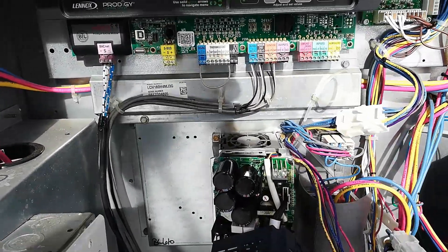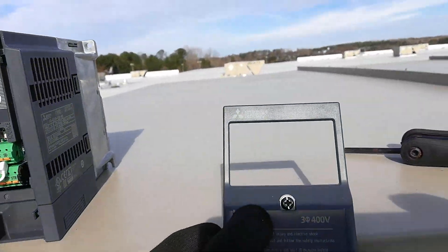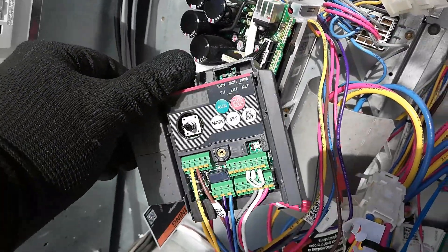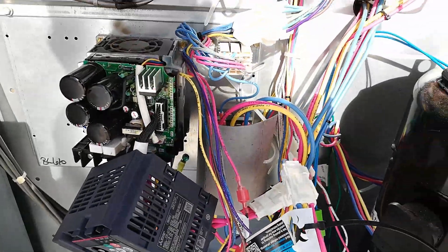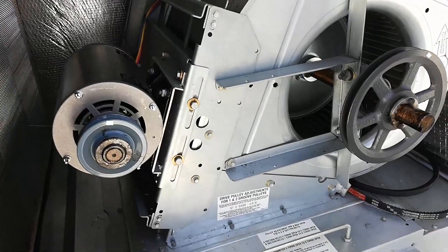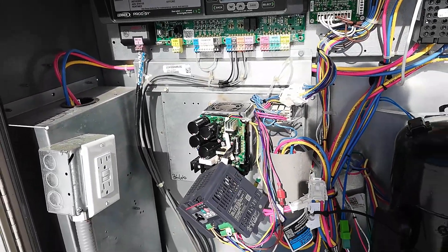Today's interesting — we have a Mitsubishi VFD that has absolutely blown its top. When I came up here the first time, the whole face was off of it; it blew its potentiometer cap off. It exploded. Working on a Lennox Big Boy 20-ton unit — I've checked power, it took two fuses with it when it went. The blower motor's good, so now I'm just going to start putting wires back where they need to go and kick it on.